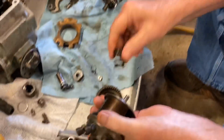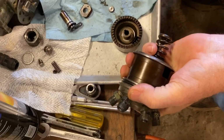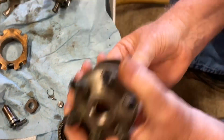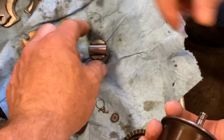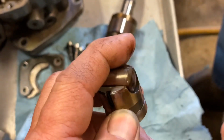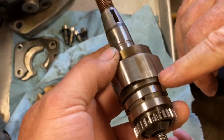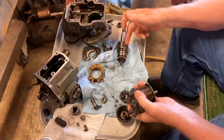Of course, this has a spring on it. This is running on a cam. All this is not here. This little button goes in here, but this basically goes in here like that. And the cam in there is lifting this plunger. So that's a roller cam. It's a roller, right. Roller bearing, just like your, well, it's not really like your car, but it's a lot like it. It's got a little half bearing in it. That's that, and then here's your cam. That's called the intravance. Intravance by Mack terminology. But that has your cam on it.